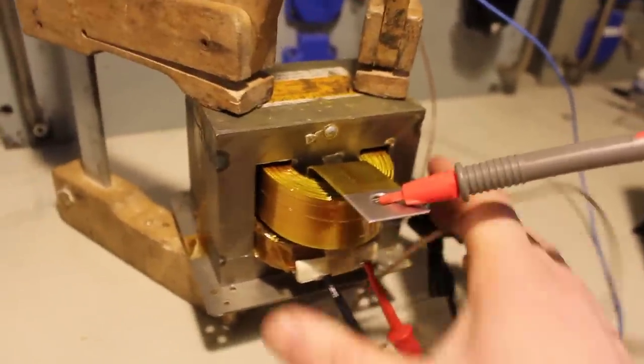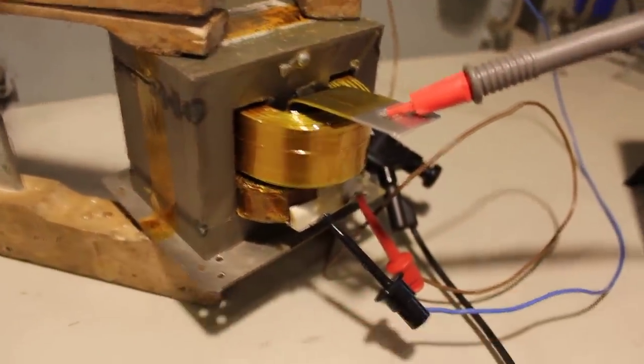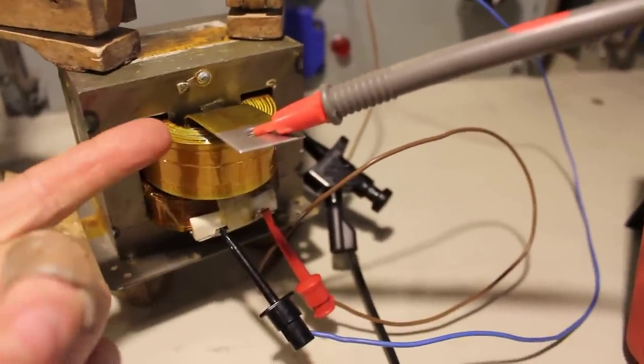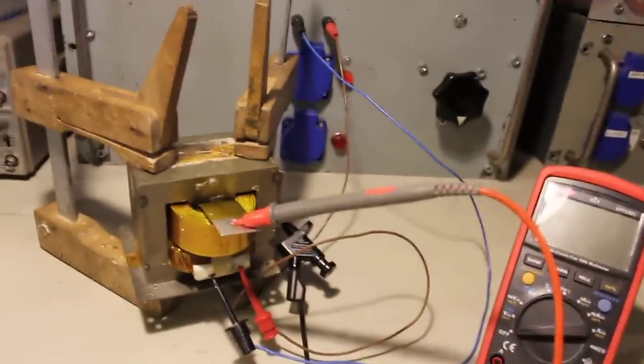I'm not very fond of just copying other people's ideas, and that's why I've been trying to come up with another method of winding these secondary windings. Here is the first of the transformers that I've actually successfully converted to a high current design — it's still held together by wooden clamps because I had to cut open the seams, the welds here on the sides. Here we can see a secondary winding wound from metal strips that are insulated against each other and against the primary winding, using kapton tape.